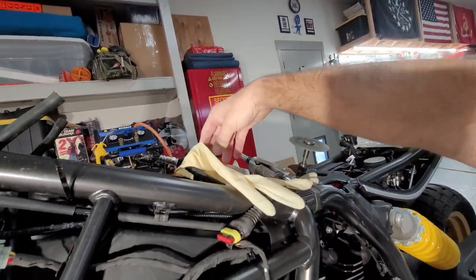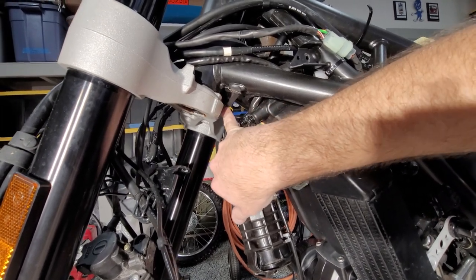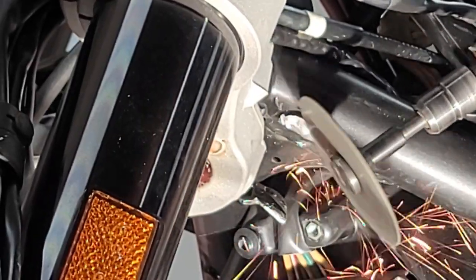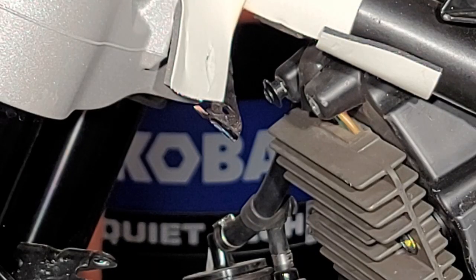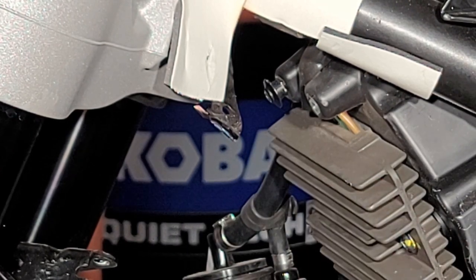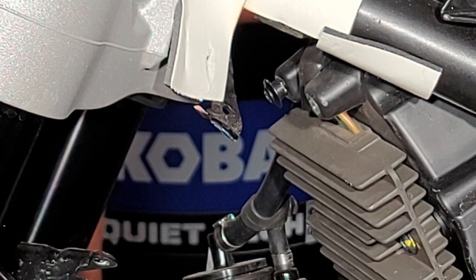That's the plan for today. I've got my cut-off wheel and wire brush — I'm going to get the area prepped and then try to bend this thing. I think I'm going to cut this tab off. I'll measure the stop point from the outer tube on the right side since that's good, and make it equal on the left side before I tack weld it and do my final weld. If I cut that off, I'll have a better chance of welding the outside and inside and then pushing it up and welding the bottom.